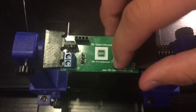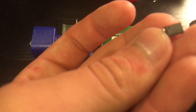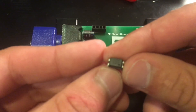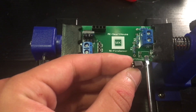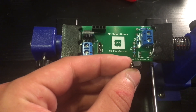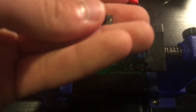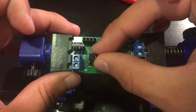The last component on the top of the PCB is the PC817 optocoupler, which gets soldered into slot U3. When you put it in, make sure you align the circle on the optocoupler with the square silver pad on the PCB. Before we flip over the PCB, put the 2-pin jumper on the 3-pin male header above the PGM side.